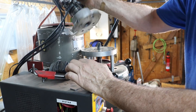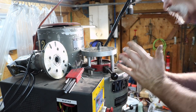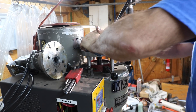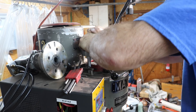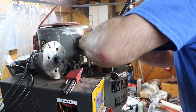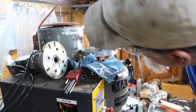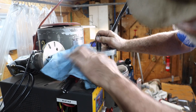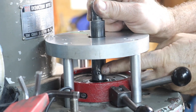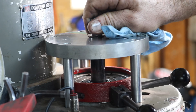Lots of oil — that's good. This top part works just fine, there's nothing wrong there. Somewhere below this. This should not be that tight in here. I can pull it up, but it's tough — that should pull right out. I think I see what's happened already. Right down in here — see that roll pin right there? That's a roll pin and it's shifted out, so it's inside the bore rubbing. It's all shiny, and if I push it down it's definitely rubbing. I'll take this off, pull this out, and we're going to fix that.